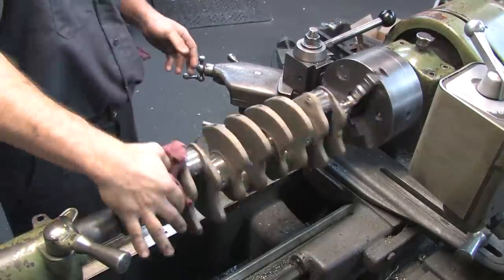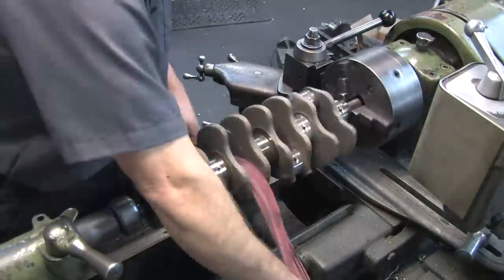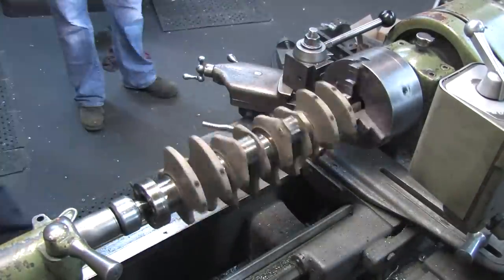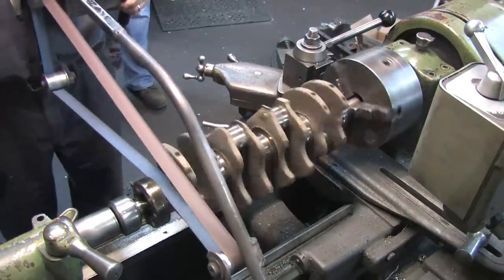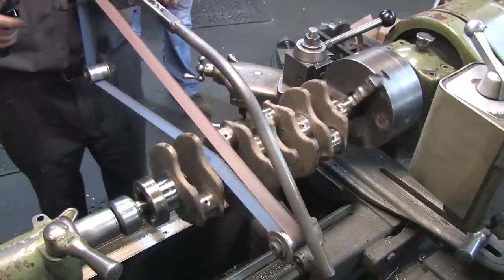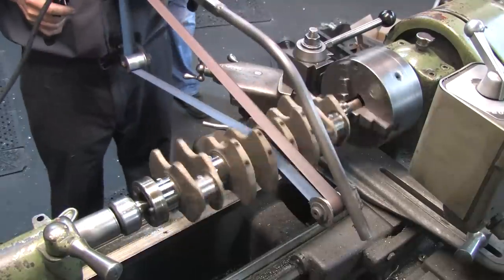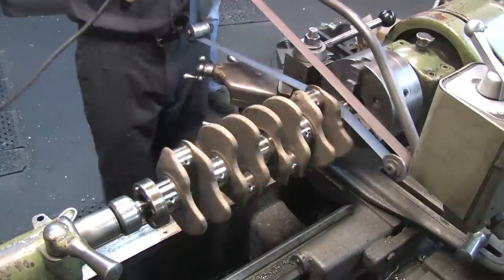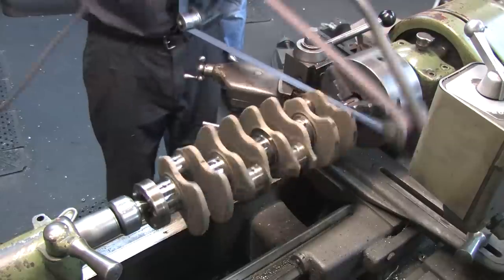Now that the grinding's finished, it's time to polish the crankshaft — it's much easier than you'd think. My 150,000-mile crankshaft was in excellent condition with literally no visible wear, which is not unusual for a 6-bolt crank. We just chucked it up in the old South Bend lathe to give it an even pass between the fillets on all of the journals and seal surfaces using a hand-held crank polisher.